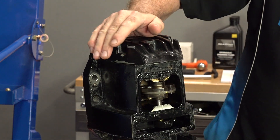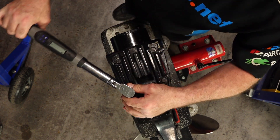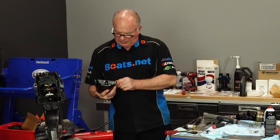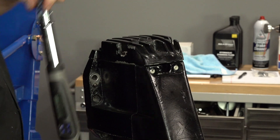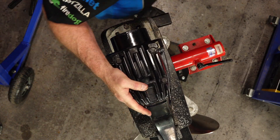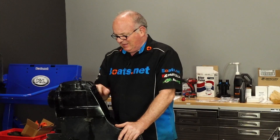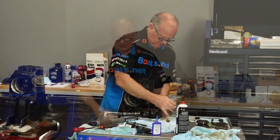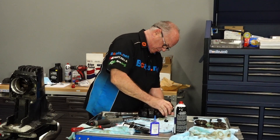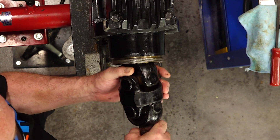Now that everybody's met together, we're going to go ahead and pre-lube some of this stuff even further and set her in place. Let's get ready for our back cover and get our new seal in. We're almost finished up with this. Just going to spin it around, install that input shaft, and then I'll spend a little bit of time kicking back some of this bad paint, priming it, and repainting it so at least it can make it through another season. The only thing I have left to do on the input shaft is just replace that o-ring, put my shim back in, and then we're good to go. I will be replacing these seals later.